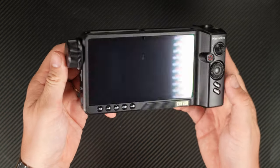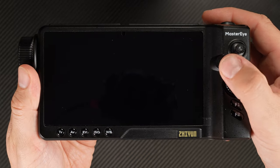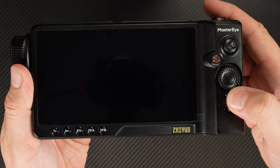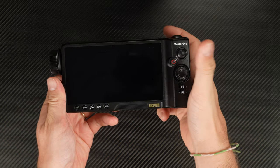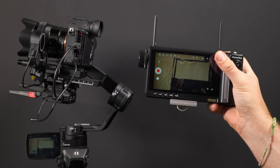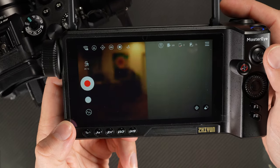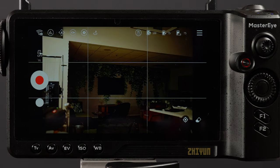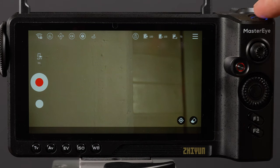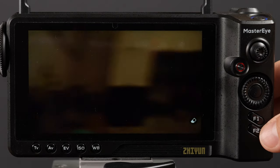There's a focus wheel on the left side of the device. The right side features a hefty grip with a joystick for gimbal movements, video and photo buttons, a scroll wheel for menu controls, a screen record button, and a mimic mode button. Because of its position on the grip, the mimic button gets in the way and we've unintentionally hit it a few times, causing the gimbal to jerk into position. Clicking the power button is supposed to lock the physical controls, but strangely it disables all controls including on-screen buttons while the mimic mode button remains active — looks like a firmware issue.